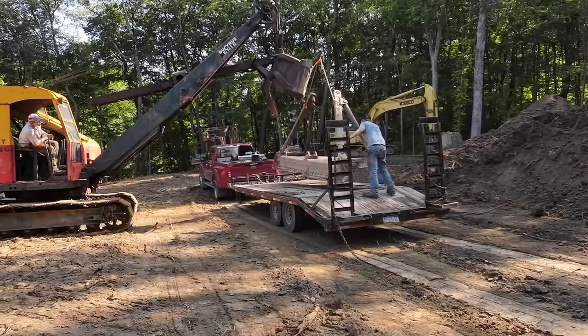Worked out just about perfectly. And just like I said, I cut that thing pretty much as tight as I could get it. And then by the time you let the pressure off and it really takes up the slack, you still have a little bit of slack in the top of the track. That's still a little bit loose, but it's really close to where you'd want it. This side over here could actually use a few more pumps of grease as well, but not bad at all. We can run it. Just waiting on Sam to get back with the lowboy now.